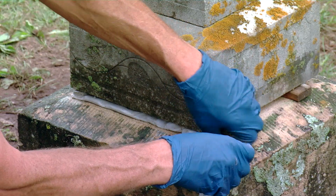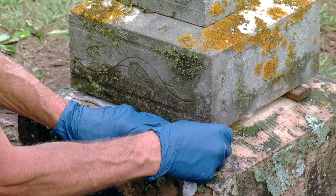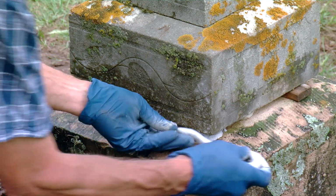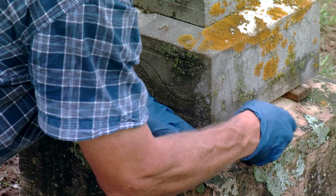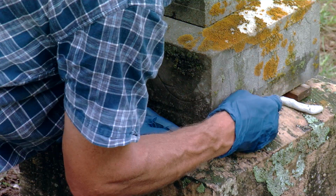And what I find also works best is that you can stretch it in place as you go. A lot of people try to roll it out, and then it turns into a piece of spaghetti, and it gets too narrow. So start with something about as big as a golf ball. Now there are little nodules of hard epoxy from yesterday that got mixed in, so I'm just cleaning them out as I go. That's just because when it was squeezed out, it intermixed a little.